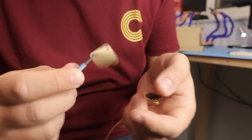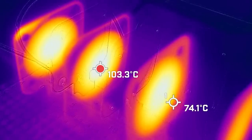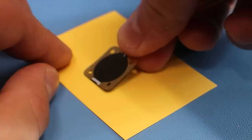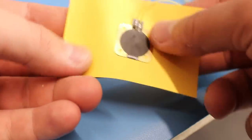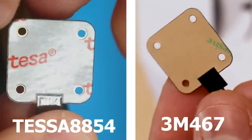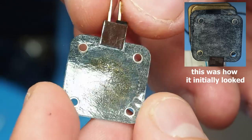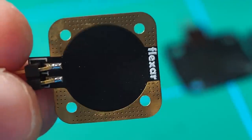Before I start testing this with origami, I had to make sure that the adhesive on the back can sustain the temperature. At maximum power, the PCB can go up to 100 degrees Celsius, so I also had to make sure that the paper on the backside doesn't burn up. I tested two types of adhesives, and after a few weeks powered on, the TESA started turning into a brownish color. The paper cover also got burned up, but the 3M adhesive managed to survive a month powered on.